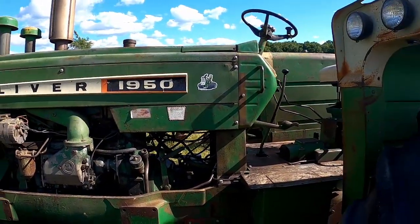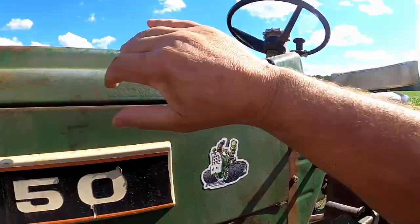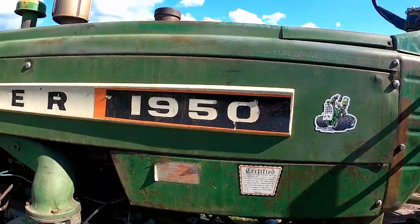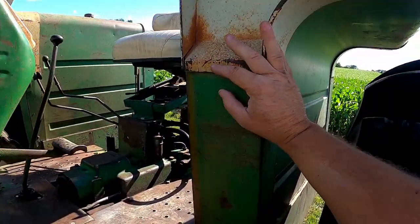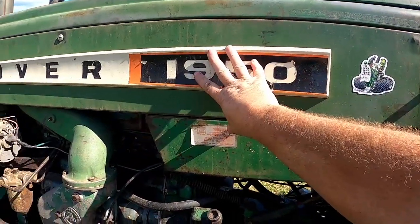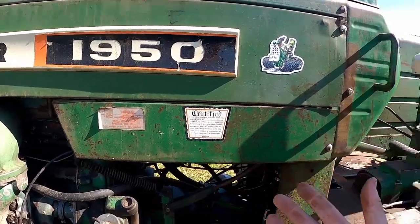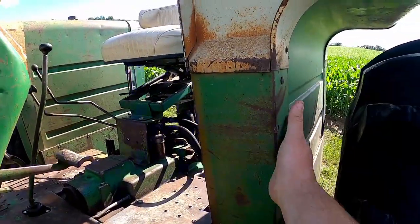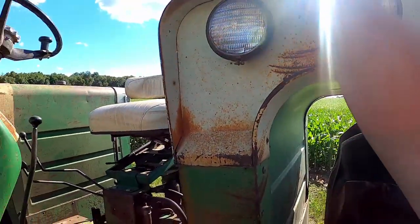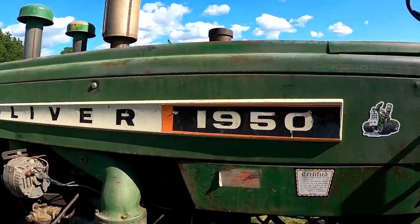If they were diesel, you would have a non-vented cap on your main tank and vented caps on the fender tanks. You'd fill up your main tank and fill up your fender tanks. As it drew fuel out of the main tank, if air can't come in you build a vacuum. That starts sucking the fuel out of these tanks, which doesn't take much vacuum because the top of this tank is higher than the other tank.